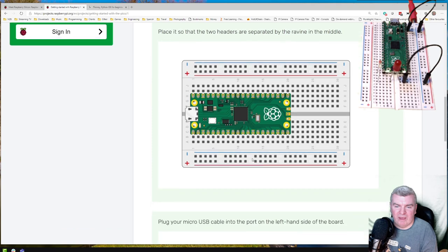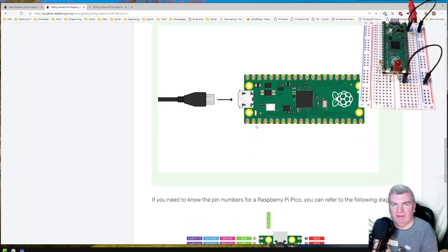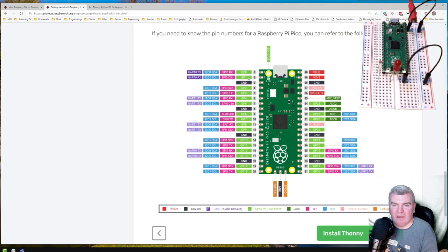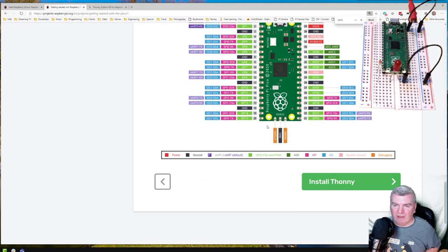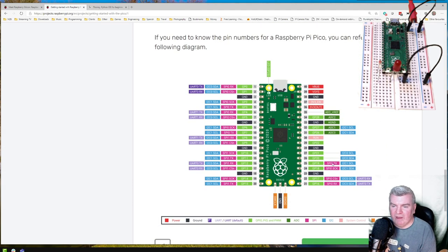This is the assembly process — stick it straight in the breadboard. This is the pin out, so there's a bunch of GPIO like you'd expect on a Pi, including I2C — there's plenty of I2C on there. There's also PWM on a heap of these as well, plus ADC, which is nice. One of the benefits of using a microcontroller over something like the Raspberry Pi is that you can do more real-time work on it. When you're running the Raspberry Pi, it's a full computer with Linux running underneath, so timing is up to the operating system. These microcontrollers are designed for low-level work, almost like an Arduino.